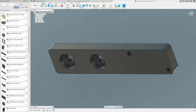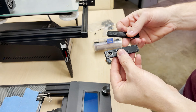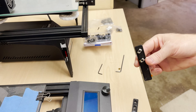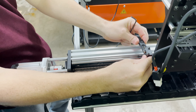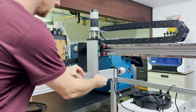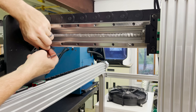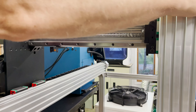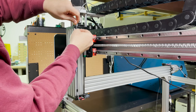Next I designed a couple different sizes of mounts for the homing switches in Fusion 360, and also a little trigger arm for the X axis. I may mill these parts out of aluminum later, but for now I just 3D printed them. I get the hardware and switches mounted and they're ready to install. For the Y axis, I designed them so that the side plates of the gantry can trigger the switches — and it works the same for the other side. My controller can check both switches independently to make sure the gantry is square. There was no obvious way to trigger the X axis switch, so that's why I designed this little arm so that it could reach it. While I'm at it, I go ahead and wire up the switches with some shielded wire and 3D print some little wire clips to hold it into the extrusion.